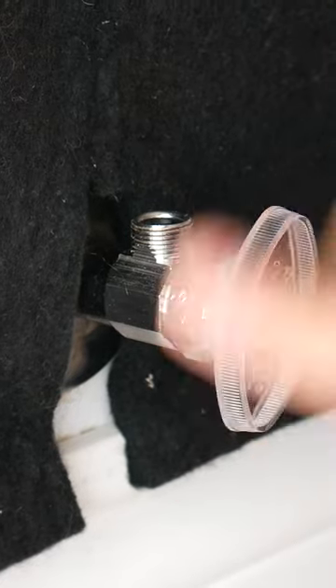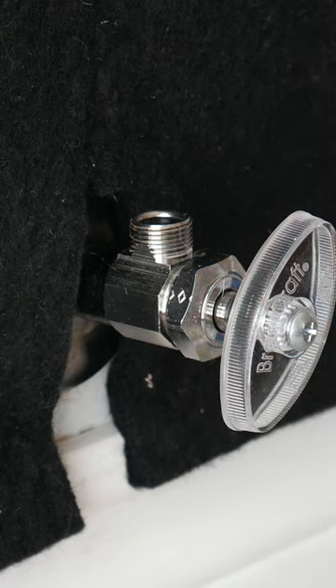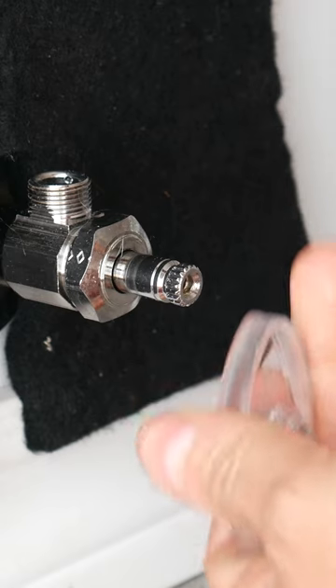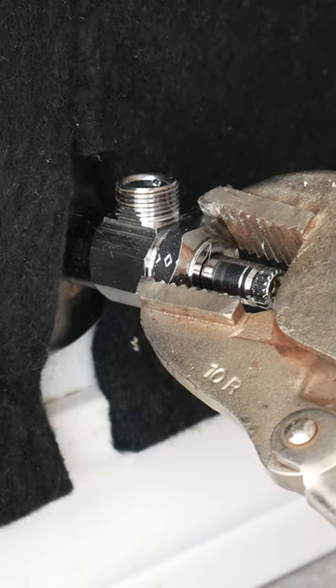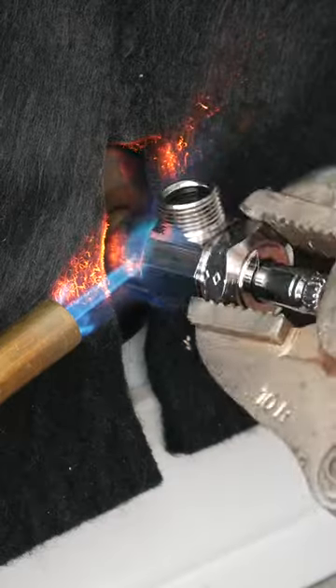The first thing I do is open the valve. This will allow for any water inside the pipe to boil off and evaporate if needed, or it'll be almost impossible to unsolder it. Then grab it with a pair of locking pliers and rotate and wiggle it off as you're heating it.